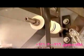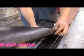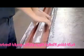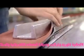They merge and stick together as they travel over a big steel roller. An unwinder peels away a plastic liner from the now 4-plied strip. Next, a worker places a piece of rubberized fabric and 1 of synthetic rubber on either side of the 4-plied strip. He presses everything except the strip of rubber around a U-shaped aluminum former.